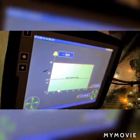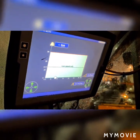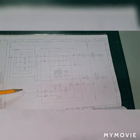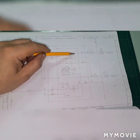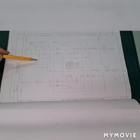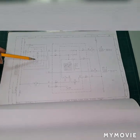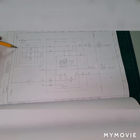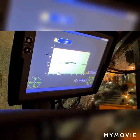I have an alarm which keeps sounding every 5 seconds — this means I have a low oil level on the crane tank. This is the wiring diagram of the siren. When the alarm comes, the K31 relay is activated and the cable is directed to the float switch on the oil level of the tank. This means the alarm is giving you a pre-warning that your oil level is below the required level and you need to refill the oil tank. If you have a problem and some alarm like this, just check the wiring diagram and you will find how to solve it.